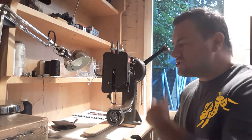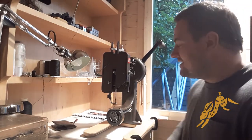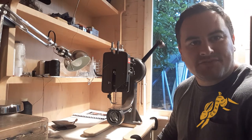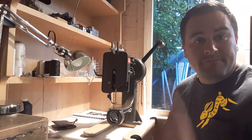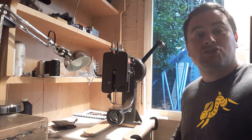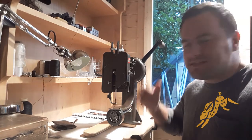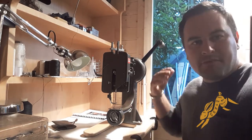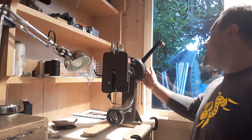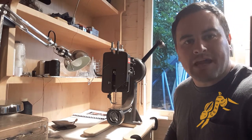So I'm going to show you around the machine. You'll notice it's got this funny little handle here because there is no motor — it's all arm power. A couple of reasons for that: one, it works my guns; two, it actually allows me to place the stitch exactly where I need it. I don't have a motor to control; I can literally slow the whole process down. This machine is capable of taking a motor, but it's not how I want to make my stuff.